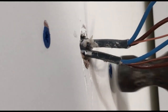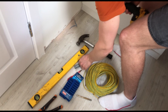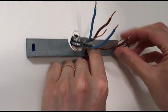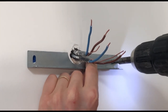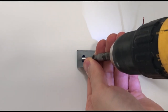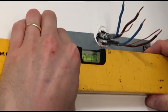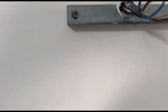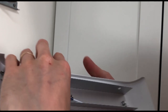Now get the bracket and screw it in using the wall plugs you've just installed. Put the bracket in position, start the screw in the wall, and slow down as you get to the end to let it grip. Place it in the centre of the oval shape, put the second screw in, and use the spirit level to check. Adjust until it's level - and that is now level. We can now start attaching the light to the cables with the connector blocks.